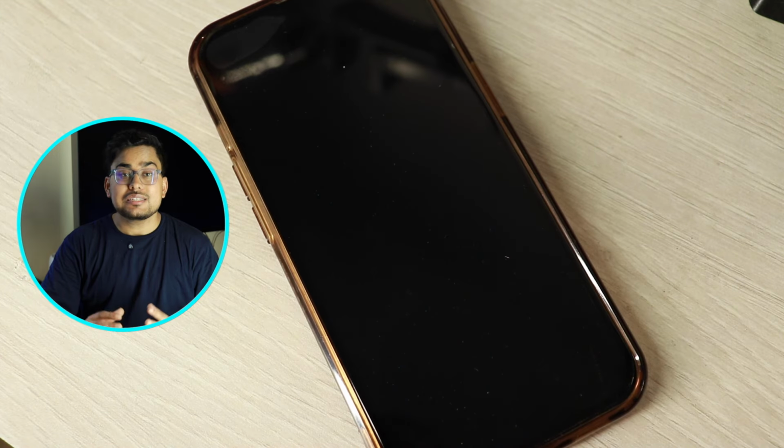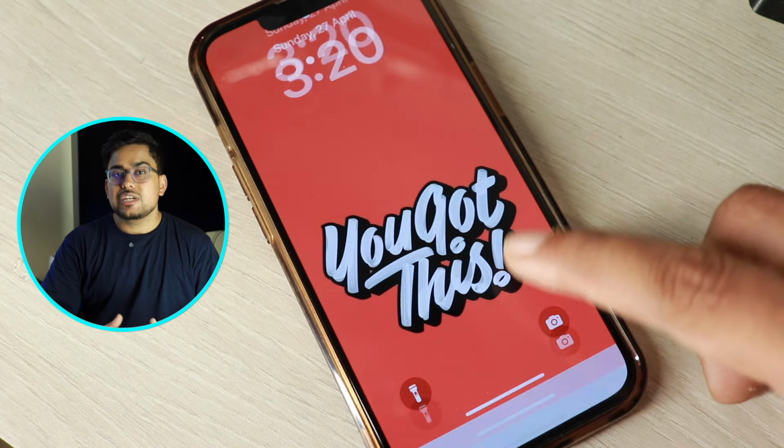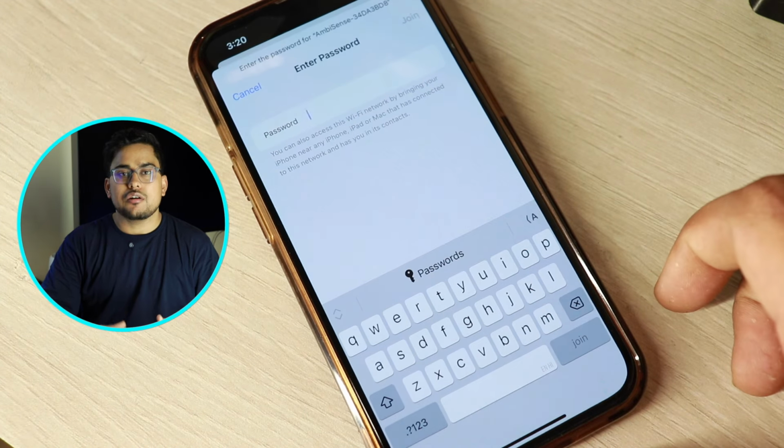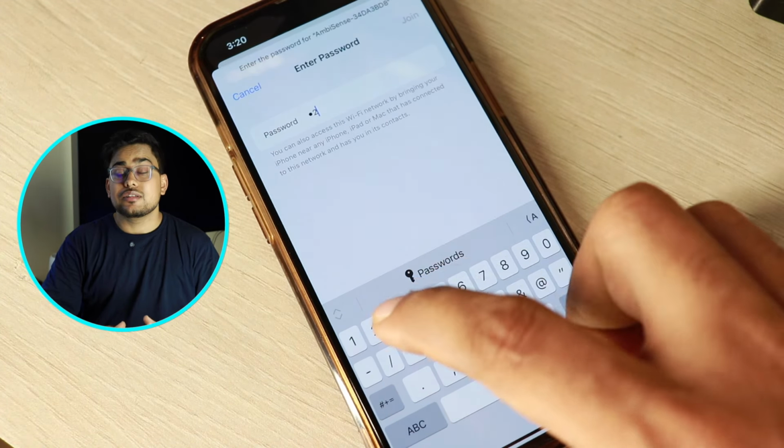Now let's talk about the features which I've built on this based on your feedback and whatever responses I've got in comments on my video that I released earlier, and also on Reddit. After you flash the firmware, the device starts in AP mode, which means you can use your phone to connect to the Wi-Fi network, the access point of this device, and then configure the network settings.